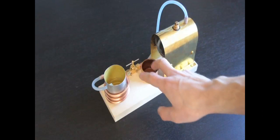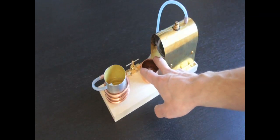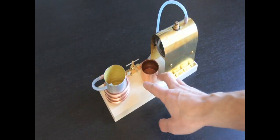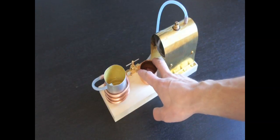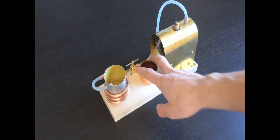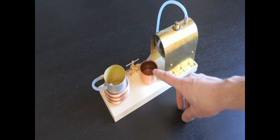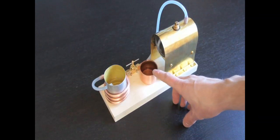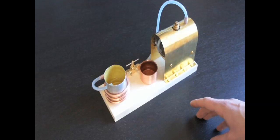The little copper cap here contains the fuel for it. Right now I'm running it on rubbing alcohol, but any kind of fuel would work. I tried it on white gas, which is Naptha, but it's just a little bit too intense and smokes a little too bad. Amazingly, rubbing alcohol burns better. Right now this is 99.99% pure denatured alcohol, and it burns, as you can see from the video, really wildly.